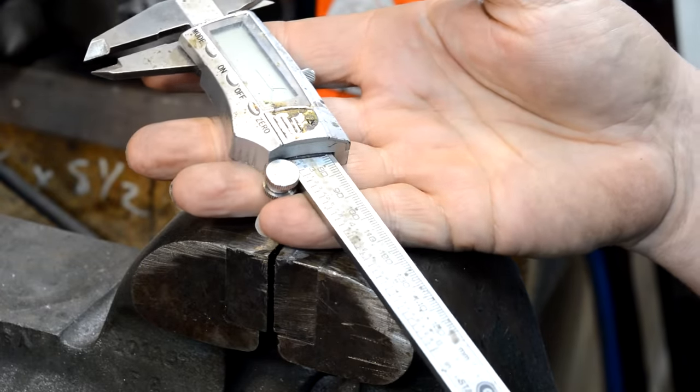I've cut my piece of stock down now to that line - you can see the line right there. I've ground that blob of weld off this thing just to get that third dimension off, and I've also ground the blob of weld off here and redrawn it. So this is essentially what we're making in profile, and this is in plan, looking down from the top. The reason why we're a little bit proud here is there's a kick in this thing - it kind of comes out just a little bit, goes that way and comes up like that.